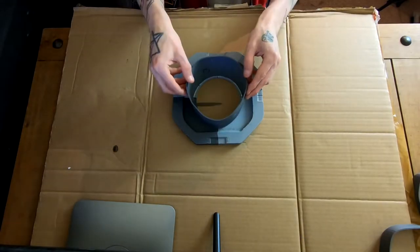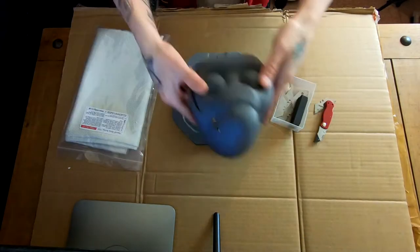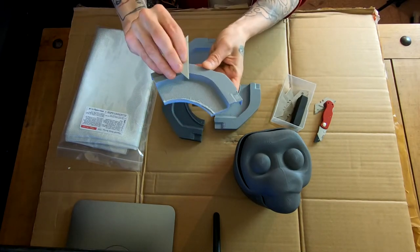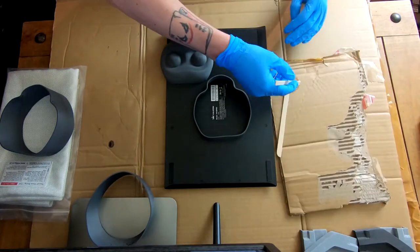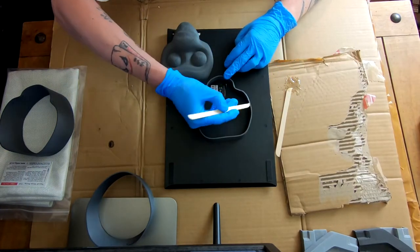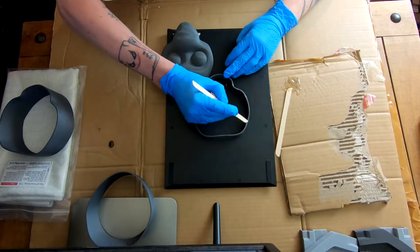So I designed this in Blender and 3D printed the parts. I 3D printed a little key there that works as a base. This was printed in a pretty strong PLA, but I'm going to back this up with fiberglass afterwards. So I just sliced it up, printed each section, and I'm gluing it together with epoxy here.